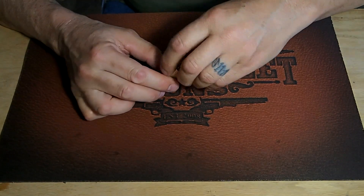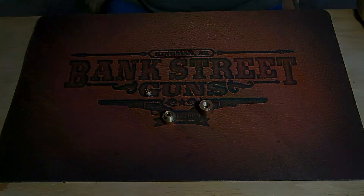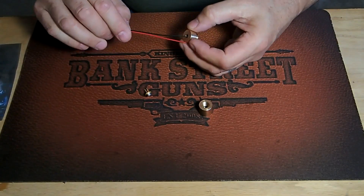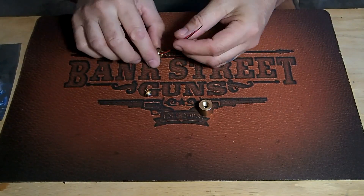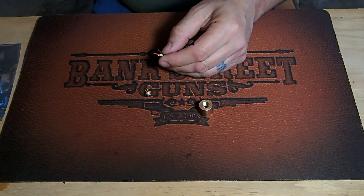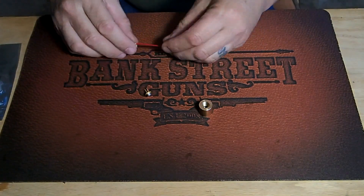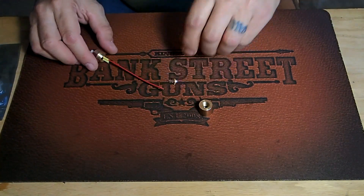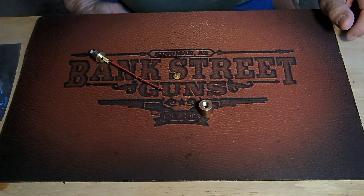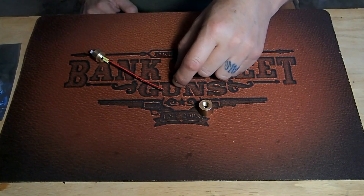Okay, so we'll just take it out, drop the diode out. You want to make sure that you always put the wires through first, then put the little heat shrink tubing on each wire here, like so. Then we're going to solder this to the diode. Now, the positive is this pin on this side right here. I have a schematic for it on my phone, so that's how I know which one it is.